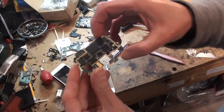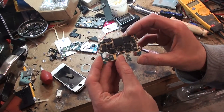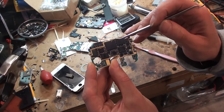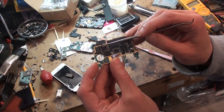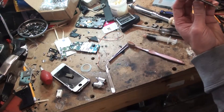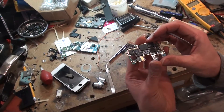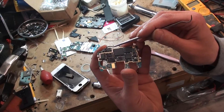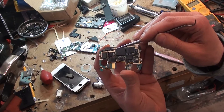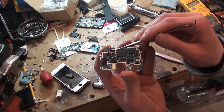Basically here's the end result: we have the new power IC right here. Remember pin number one — this thing is hot — pin number one is over here. You see where the battery connection is? Pin number one is right there. There's a little tiny circle that you'll see on the IC right here.